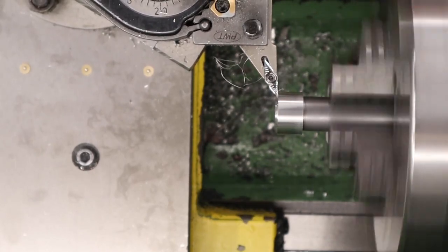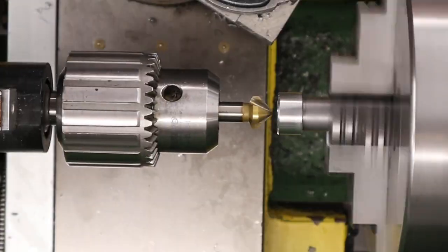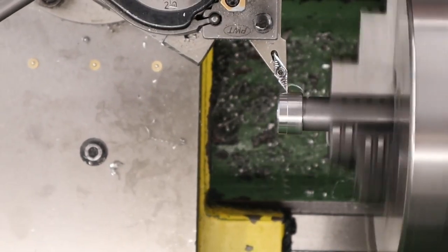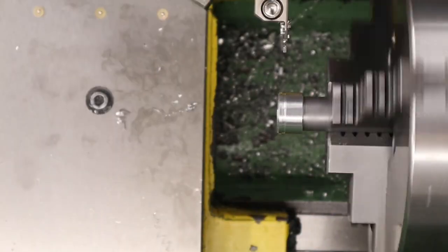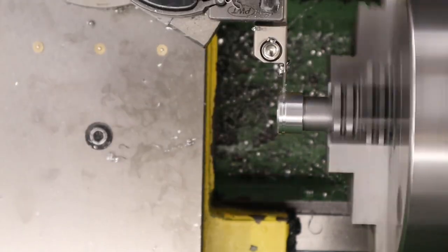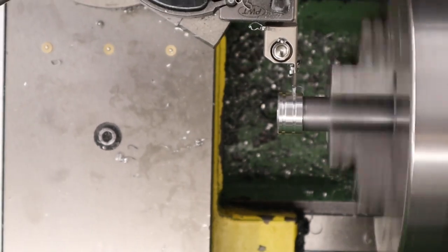Next up we're finishing off the front shroud support, holding it on a male half inch UNF mandrel — similar to the female one we showed, although this one is male. We face the end, chamfer each side, then turn the OD to a nice clearance fit inside the carbon tube. Once that's done we can start turning the o-ring grooves, which will ensure the carbon fibre tube stays nice and central to the barrel. The o-rings we're going to be using are 1.5mm thick, and I'm just checking the fit with the carbon fibre tube — the goal is to make it a nice tight fit but one that's easily removable.